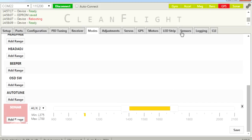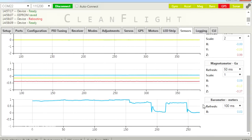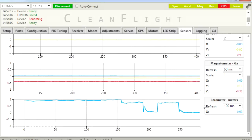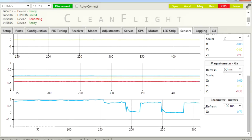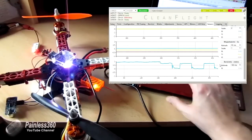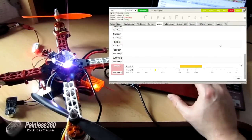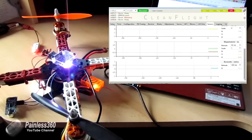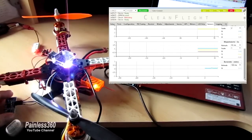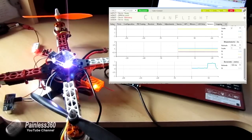Even with sonar mode not explicitly enabled, let me show you how to check everything's working. Go into sensors. You can see that if the sonar is resting on the table we get one height reading. But if I push the sonar out so it can see over the edge of the desk, we see the additional height registered within the graph. Put that back on the table. What this means is that even without sonar set in modes, sonar is still being used along with the barometer to figure out the altitude of the craft. Push it over the edge — we see the increase in height. Back on the table — that height disappears. That's the simple way to test whether the sonar is working.